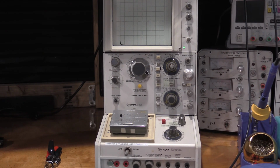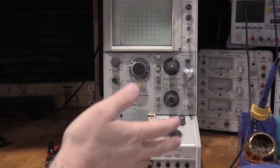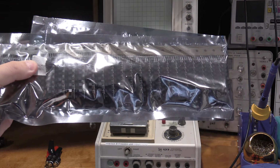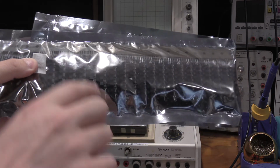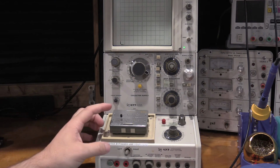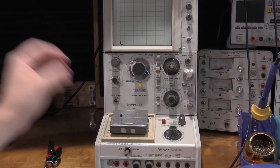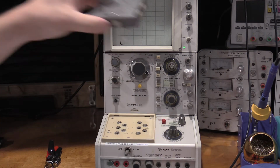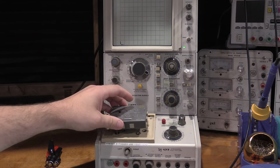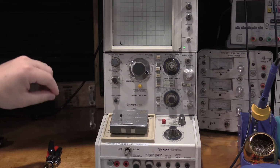again for one of the most generic transistors on the planet, as I have about 500 of them in here. Kind of see them all in there. This is probably one of the most jelly bean transistors out there. This is a 2N3904, or 6. 2N3904, so this is the NPN version. The 6 is the PNP version.